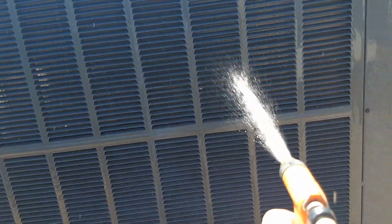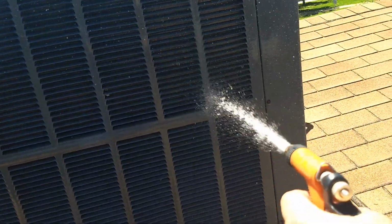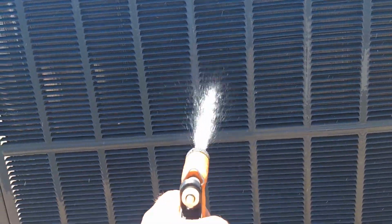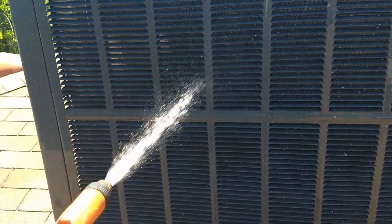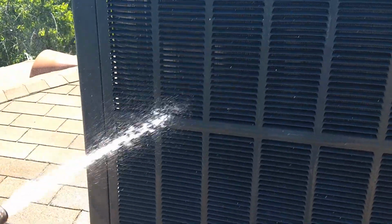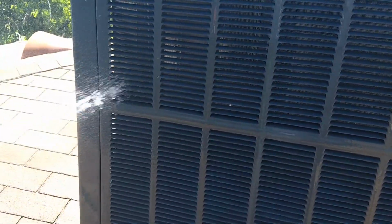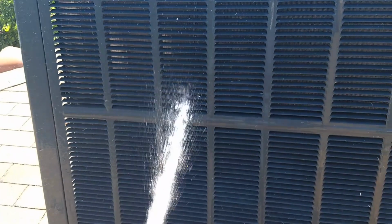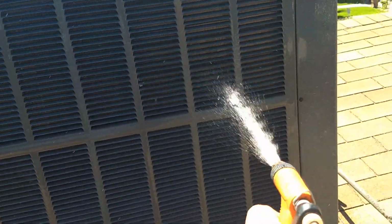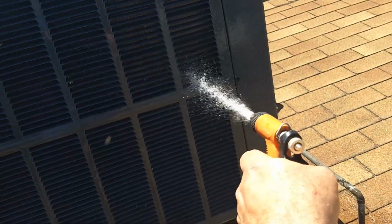If the condenser coil gets too darn dirty, then your head pressures go so high that it eventually becomes damaging to the compressor. It'll start out by just short cycling on an overload, and then the troubles just get worse from there. The motor's working so hard, it just reduces the longevity of the motor.